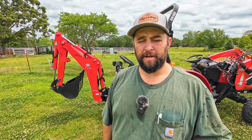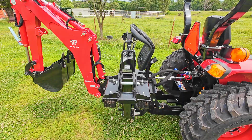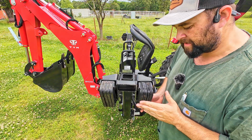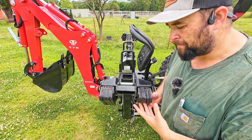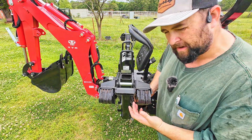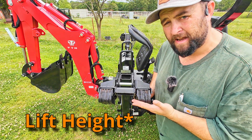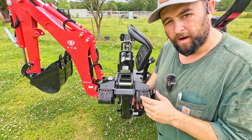They just put a little bit of cushion in there, but that's the main reason to have rubber shoes on your backhoe. Now grip wise, steel is gonna slide a lot more on concrete versus a rubber laminated pad like this. This is gonna get fairly decent grip and it's not gonna mar anything up. Okay, now this isn't really a deciding factor on any of this either, but adding these shoes did give me about 2 more inches of potential lift capacity out of these outriggers. Again, not really a deciding factor, just something I really was unaware of till I installed these.